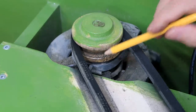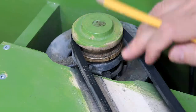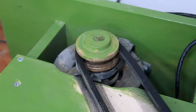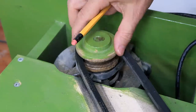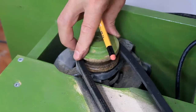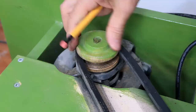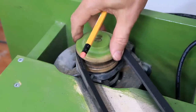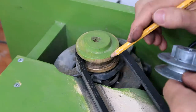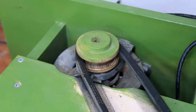This pulley is made out of very hard wood and if it ever breaks I might glue it back together with construction adhesive. I should have left it a little bit wider for more support. A problem with a wooden pulley is it's not very good at conducting heat away. So if the machine stalls such that the motor still turns but the belt doesn't move, you have a lot of heat being generated and the belt isn't moving to carry it away — unlike aluminum, wood doesn't conduct that heat away quickly, so you end up with a smoking belt pretty quickly.